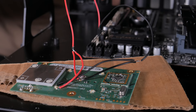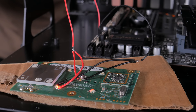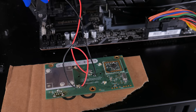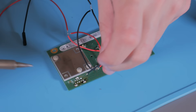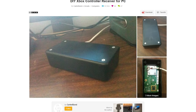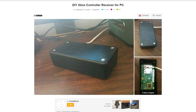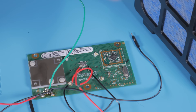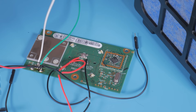First test was sort of a success — the center green LED lit up, but the player 1 LED was red, and after referencing the pinout diagram I found I had soldered in the wrong place. Also LED D3 was lighting up unexpectedly. Try 2 was a fail, but the third time was the charm. The power button was super simple — I just followed the diagram and soldered one jumper to the pin and one to ground. I then found an Instructables project showing how to wire this exact RF board to a USB cable and use it as an Xbox 360 wireless receiver, so I soldered 4 more jumpers to the top pins, connecting to an internal USB 2 header on the motherboard.